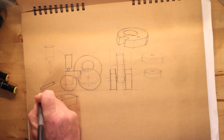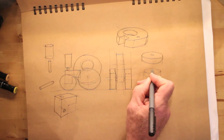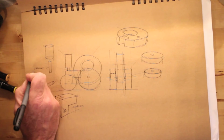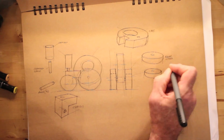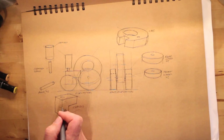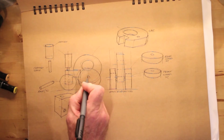Now we need to put some dimensions on this, and the students at this stage would be introduced to the real product and shown the actual physical toy. That allows them to look at a little bit more detail rather than just analysing an orthographic view. And from that, using measuring equipment like calipers and rulers, etc., they would take dimensions, some of which would be recorded in 2D, some of which would be recorded in 3D. In this example, there's probably more 3D than the students would do first thing, but the idea of the 3D drawing here is to say, look, these are basic forms.